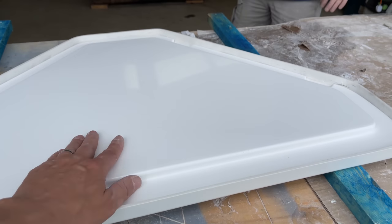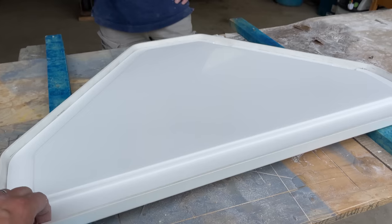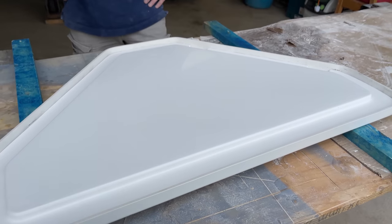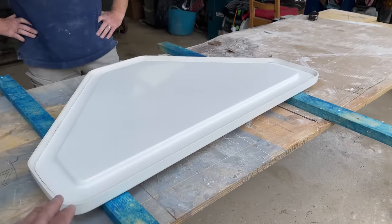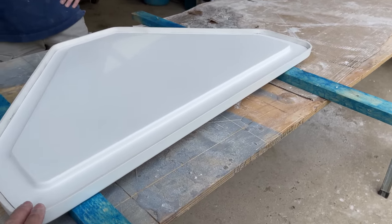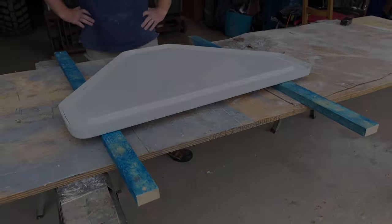The ply's in there — we've got our 9mm ply — and what we're going to do now is pass this back to Melton Fibreglass and they're going to bond this for us. We've never bonded two pieces together before. I'm sure we could do it but Paul's offered to do it for us, and rather than wrecking the part we're going to let him do it. We'll drop this over to Melton Fibreglass next week, get it back in a week's time, and then we'll just need to flow coat all these edges and that anchor locker is finished.